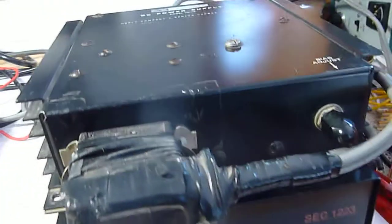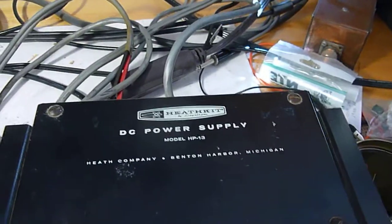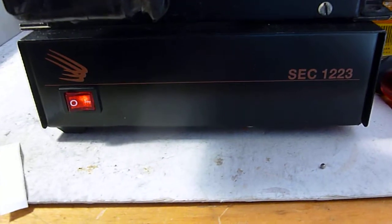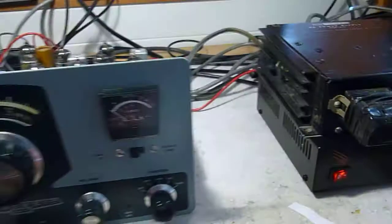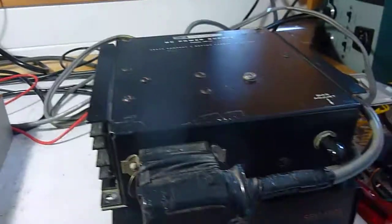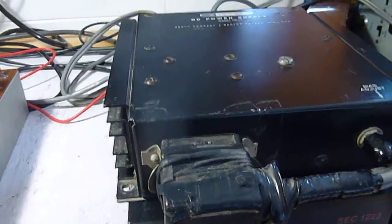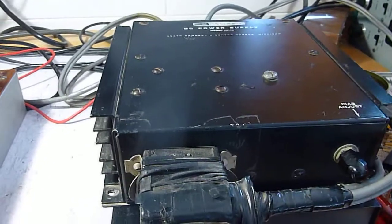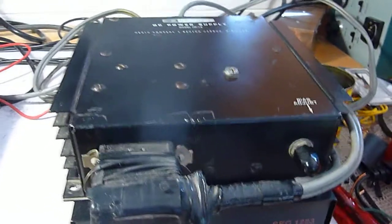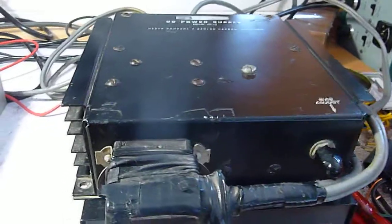By the way, I have this thing hooked up to an HP13, which is the Heathkit solid state power supply — the DC power supply for mobile operation. And there's the bias set control. To simulate a battery, it's hooked up to a solid state power supply. Now let's go ahead and turn this thing on. You'll notice right away we got a whine out of this — I think that's normal. You would like to have that power supply six or eight feet away from you, and preferably in a trunk or somewhere where that noise wouldn't be heard.